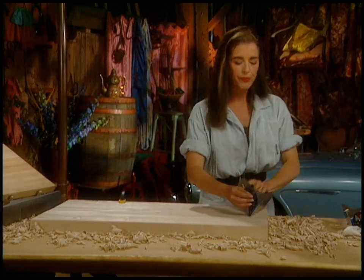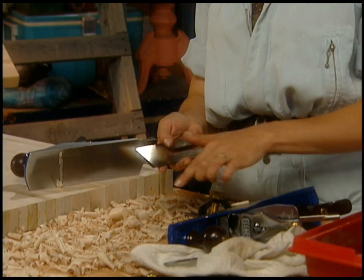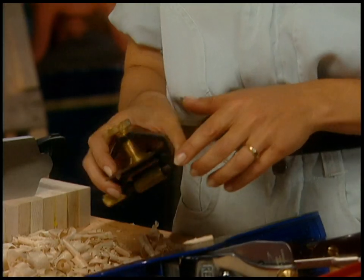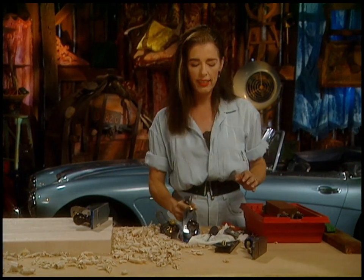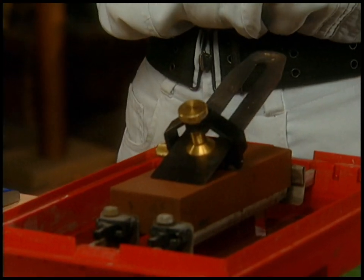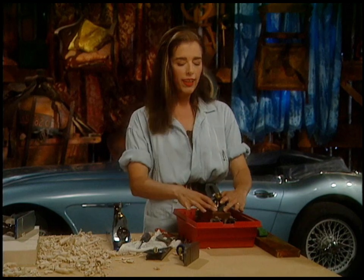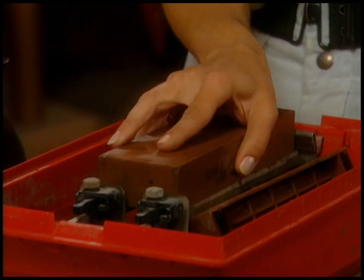I just want you to know — here's a couple of blades. This is Gord's blade, and this is my dad's old plane blade. It was really hacked up, but look how shiny I was able to get it. I have to work this surface up too so that it's just as shiny. Both the back and the front need to be shiny, because these things come from the factory with grinder marks all over them, and you have to get those out. It takes ages and it's really tedious. But here's a tip: this little thing you buy at a woodworker specialty store just keeps the blade on the right angle, so you don't have to think about it — you just mindlessly go back and forth like this for hours. You'll think important thoughts. You get an 800-grit Japanese water stone, and you keep it wet because the water floats away the metal particles so they don't get stuck and sludgy in the stone and stop it doing its job.